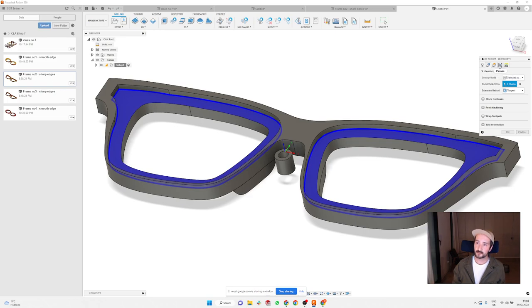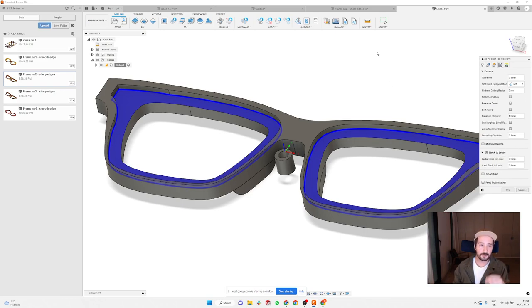Then here are a few important things. When you go through the fourth tab, passes, if you use a 2 millimeter tool, never go deeper than 2 millimeter on one pass, because it's going to vibrate quite a lot. So I would definitely recommend doing multiple passes, even if it seems a bit excessive. If you go, let's say, 1.5 millimeter, that's going to be enough. And it's good in this case to use the finishing cut. When you cut almost everything, just leave 0.1 millimeter and do the final cut to basically polish the surface so you don't need to touch it afterwards.